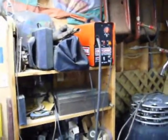I did some 18-gauge sheet metal welding on it, and if your technique is really good and you put a heat sink on the back or something, you can manage — but it's still a really dirty welder. The welds themselves are all covered in slag when you're done. They're not nice and clean, and I just hate doing it that way.